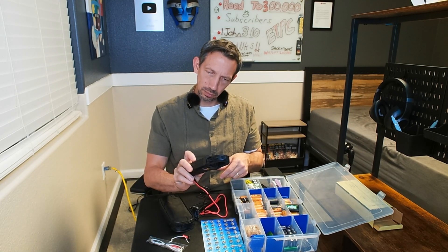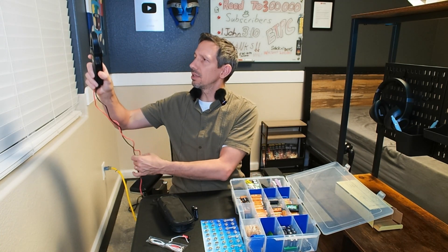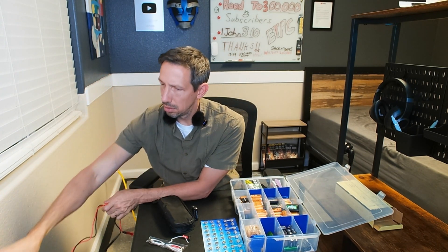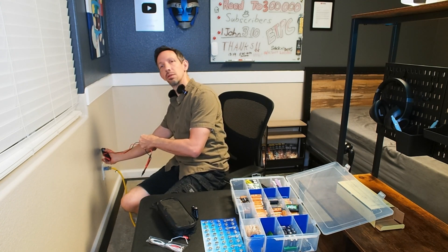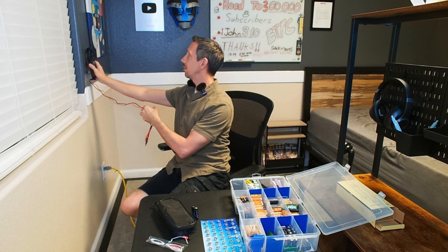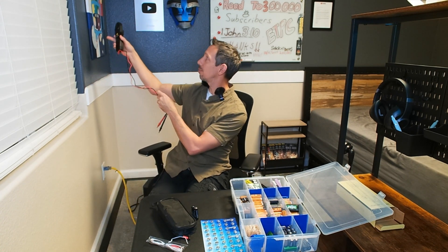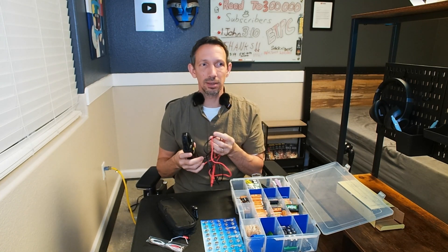Super easy to test if you have a bunch of batteries and you're wondering if they're still good — like if you put them in a remote and the remote's not working, you can find out if it's the remote or the battery. Also, with the probes disconnected, this is basically wireless and will sense any kind of energy at all. The closer you get to a wall outlet, it really tells you if there's electrical in the walls. I know that wire is going up through the house right there because this is super sensitive. So if you're going to drill a hole in the wall, you can make sure you don't have wires there.